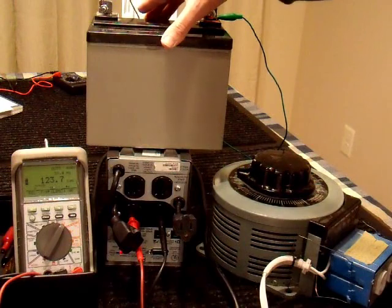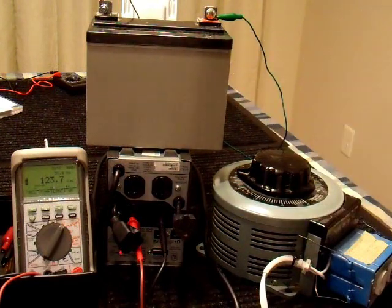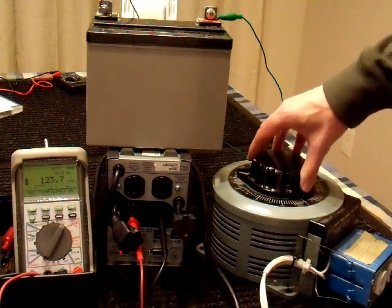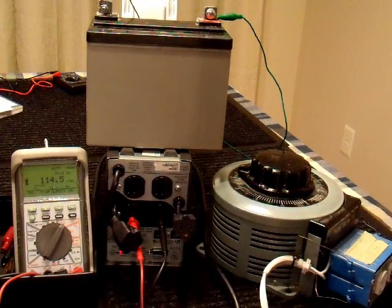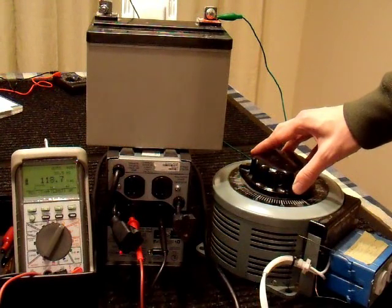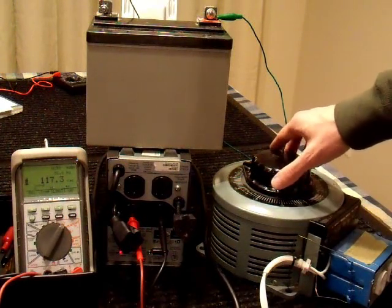It's still connected to the battery. Here's my voltmeter again — it's an RMS meter, so it should read the correct voltage whether on battery or wall power. Right now the incoming power is 123.7 volts AC. If I adjust this higher, slowly turning the knob, you can see the voltage going up — 128, then it clicked and jumped to 114, so it went to a different winding on the transformer. Now it's switched to battery power because the incoming power voltage was too high.